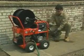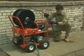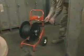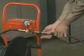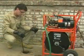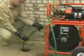For optimum performance, use the hose and nozzle that match your job requirements. Use the 3/8-inch ID hose for clean-outs, 4-inch through 8-inch floor drains, and septic lines at distances up to 300 feet on gas jets or 200 feet on electric. Also use the 3/8-inch hose when connecting the jet to accessories like the cart reel. With the 1/4-inch hose, you can clear 2-inch through 4-inch lines more than 200 feet on gas jets or 150 feet on electric. The 1/8-inch hose has the flexibility to get through inch-and-a-half and 2-inch lines and tight bends up to 75 feet down the line.